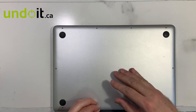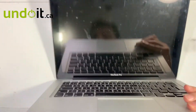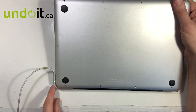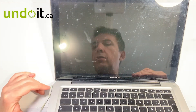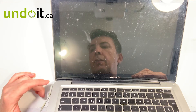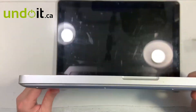I'm just going to put one or two screws. I want to show you something. So this machine, as you can see, with the charger it gets light, but it doesn't turn on. The fact that we get light on the charger is good news — it means that there is 12 volts on this machine and also 3.42 volts, because that's where it comes from.